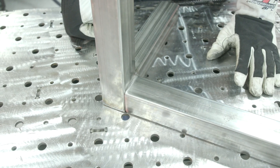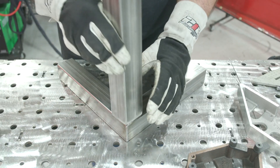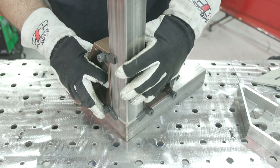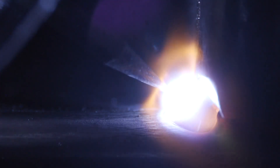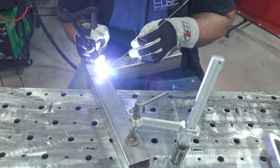Now I'll show you how to tack it together square. Since it's ground flush, you have a nice seat. We're going to use the Fireball Tool mini squares to get a nice 90-and-90 fit on the corner. First tack goes on the outside corner, then the next tack follows on the inside corner, then on the sides. Once it's all tacked up, it's just welding it out.